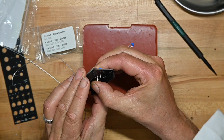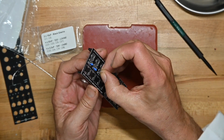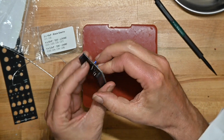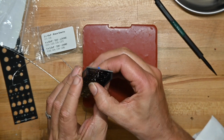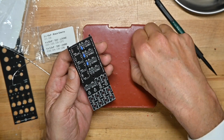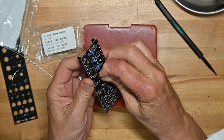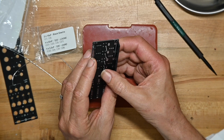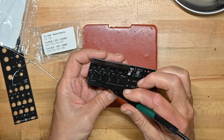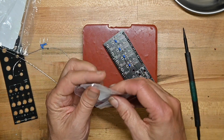because it's going to be a little tight over here. It's not going to be much of a problem, but if you're going to build one of these, and you haven't done a lot of soldering, or you're not necessarily comfortable with being right up against the edge or something, I would go ahead and populate the board and then put these pin headers on. Again, it really only matters for the securing lugs on the pots. So it's not a huge deal, just I would do it the other way.